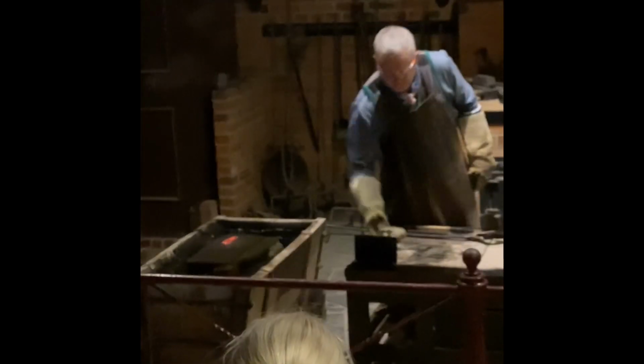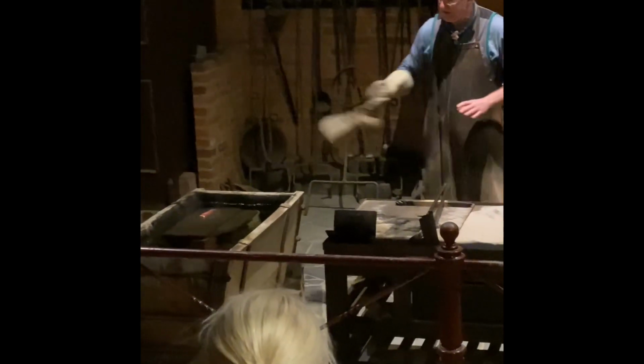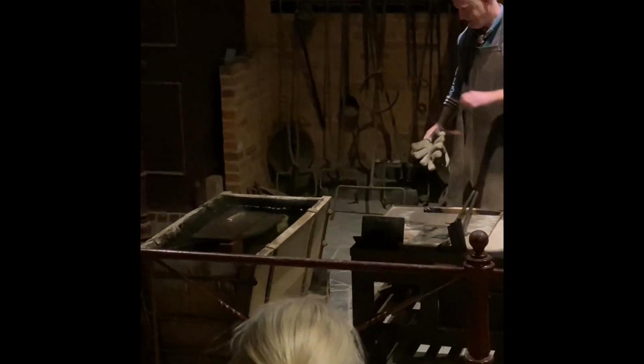3 hours to cool down, but we don't have 3 hours. Speed is pretty fast. Now, a little bit of time in the cold water. That'll allow the gold to get rid of that heat. And that'll go from 900 down to about 90 in about 90 seconds. Best way to test if that's safe to pick up, so that I don't burn myself, to make someone else pick it up. No. Or feel the temperature of the water. Now you expect that water to be quite warm.